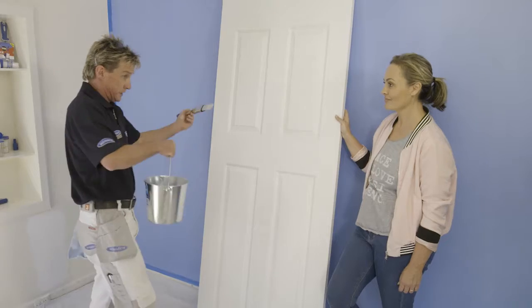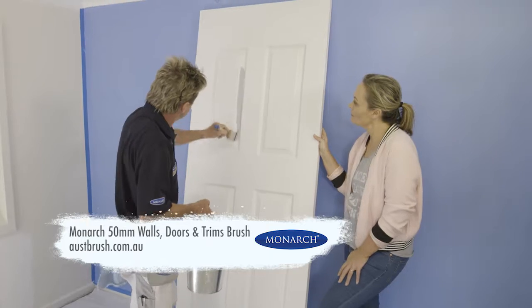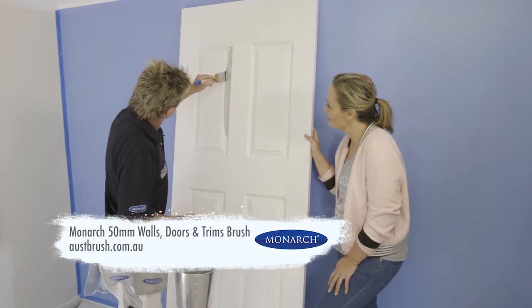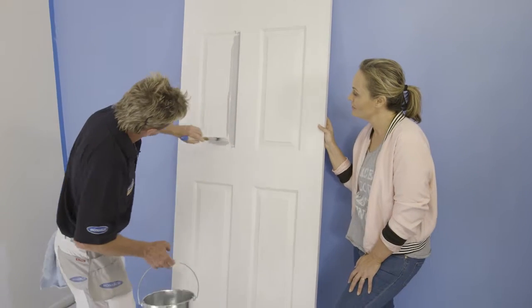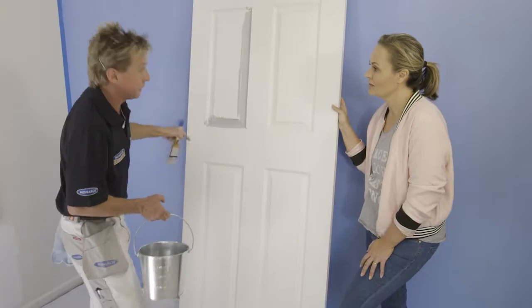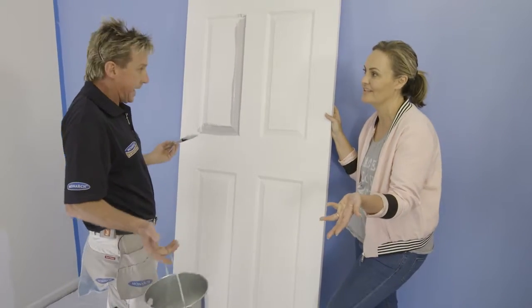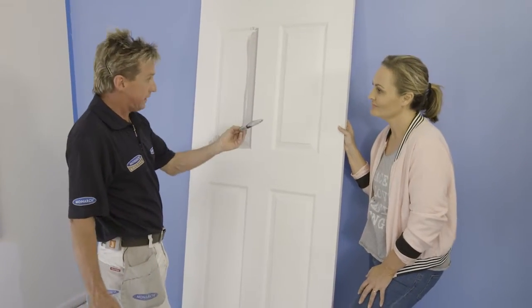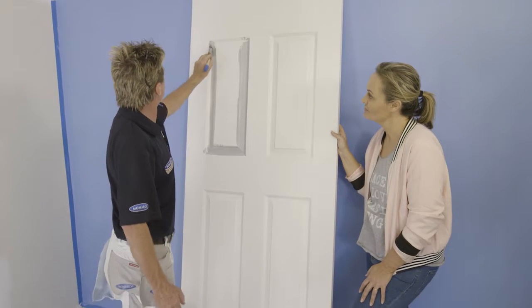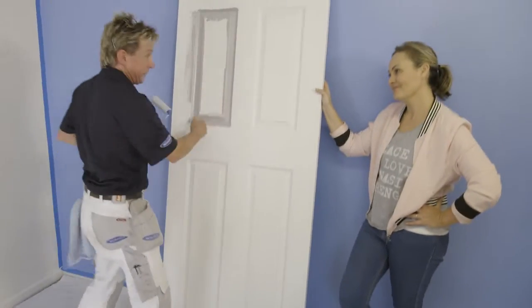The first thing we're going to do is paint inside the molding using our quality brush. That's going to hold its shape so we get a good finish. Not too much paint — if you put too much on, you get drips all over your door, and once it dries you have to sand them off. I load my brush with just enough paint to let it glide and get inside that molding. Any loose bits, just feather them off.